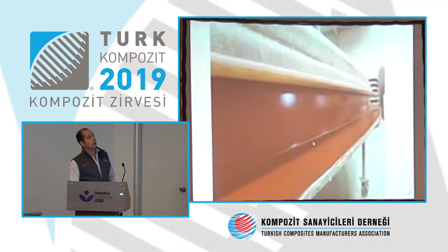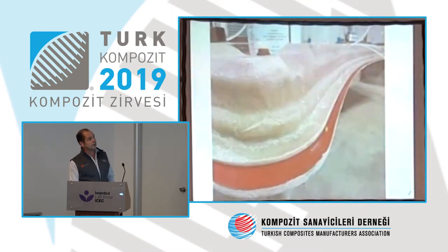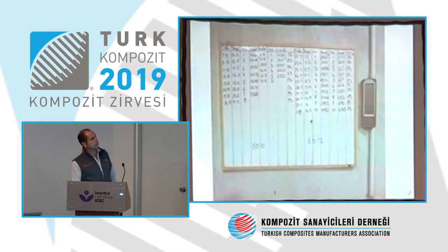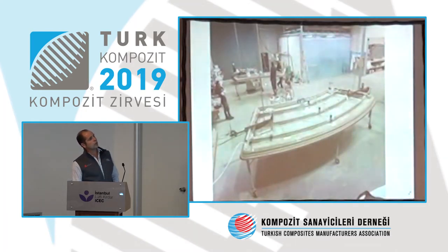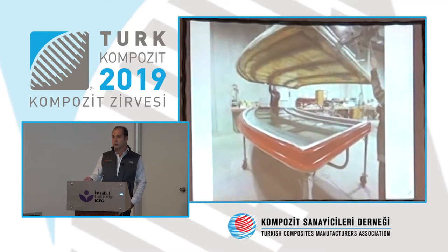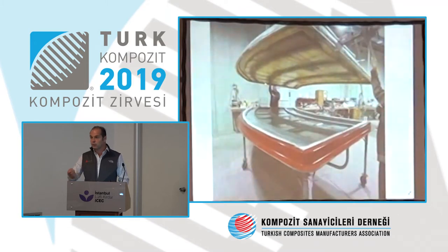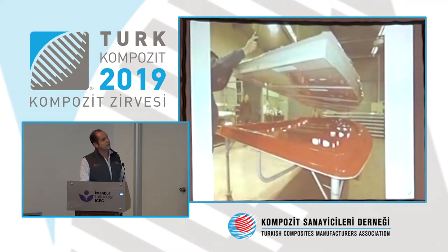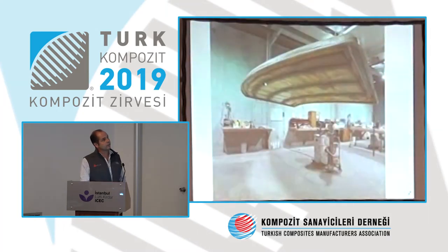They load the glass and close the mold. Nobody works on the mold anymore because they use what we call the vertical flange. When the counter mold touches the female mold, there is a lip seal — just apply the vacuum and everything seals automatically, making it very easy. They continue injecting the same way: in the middle, then on each side. Production reaches around 6,000 parts. When demolding, everything must be clean — no cleaning of mold or counter mold, no removing gel coat or resin with tools that would strip the semi-permanent release agent. They screw through the metal insert, attach the lifting system, and demold the part.